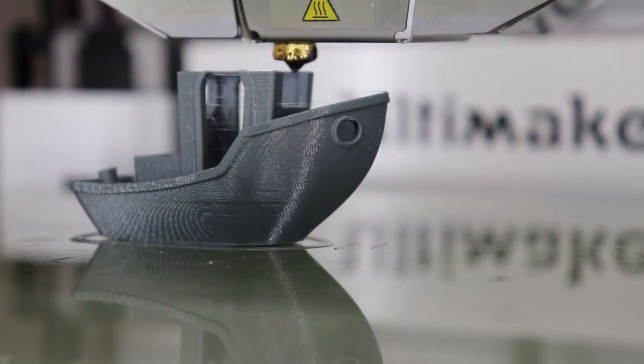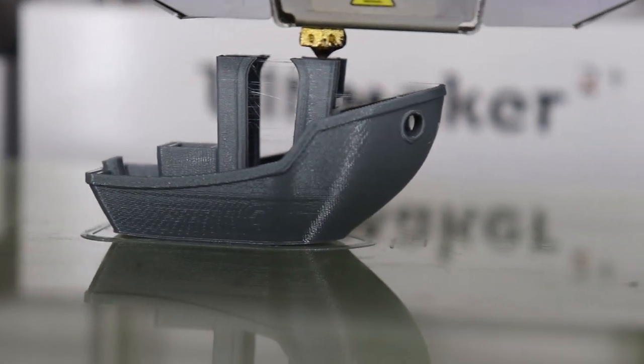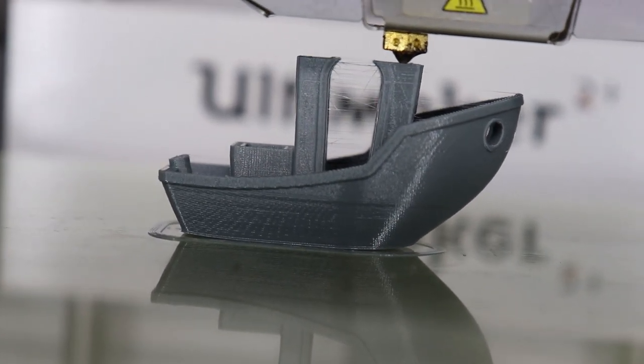Why not do a benchy? So I did a benchy. For reference, I was printing the first layer at 257°C, and then the second layer and beyond was going to be 255°C. The heated bed was at 110 degrees Celsius. The first print looks like at first glance it came out really well — it did a really good job of bridging. But as I started to look at the print, I realized it looks a tad bit over-extruded. So I did the extrusion multiplier test at a lower temperature — 251°C. The extrusion multiplier test cube looked fantastic. I did the measurements — no changes needed.